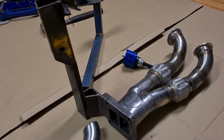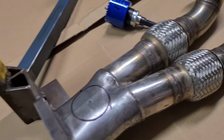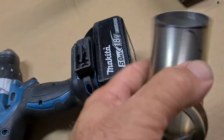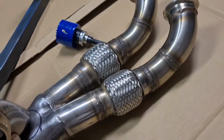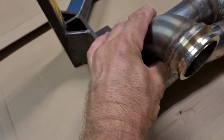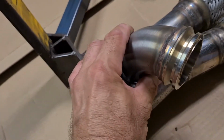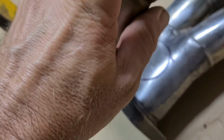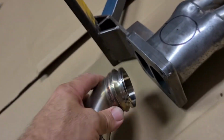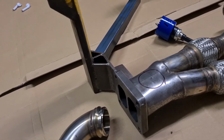Okay, this is the custom made bracket for the GT45 turbo. All I'm going to do, this is just a sort of dummy screamer pipe that I used off another wastegate just to do the circle. So I'm going to get an elbow similar to that and just probably bring it out on that angle, or possibly, yeah, it might go like that. That's going to be welded onto there. That'll have a hole in it, and then obviously it won't be this piece, there'll be another elbow. I'll weld a V-band onto it and then put the wastegate onto that. So yeah, see how I go.